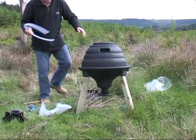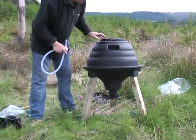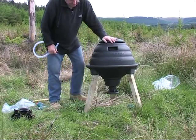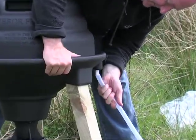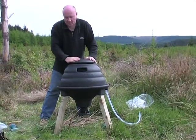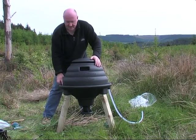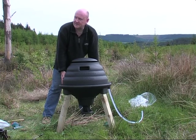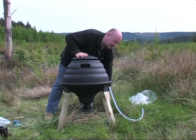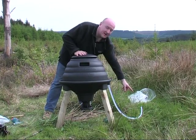Next is this section of tubing — how this operates: when you get the lid on, this acts as a rain collector. We have an area here where we can fit the hose, which allows us to harvest any rainwater. As rain drops onto this profile, this shape acts as an inverted umbrella, collecting the water and keeping the high-traffic area immediately under the feeder dry — which is very important to control disease. I'll show you what you can do with the collected water later.